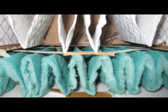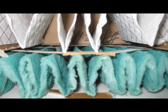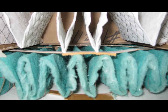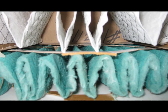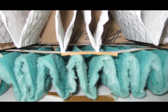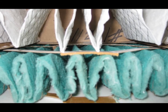The material of the media itself is also a factor going largely unchecked, mainly due to the fact that most pleated filters use a coarse fiber synthetic media as opposed to the more costly high-loft fine fiber. The big difference is in how particulate loads onto the media. With coarse synthetic medias, particulate loads predominantly on the face of the media, offering the lowest possible dust holding capacity. However, by using high-loft fine fiber media, the particulate can depth load into the fluffy media and still allow a path for airflow, resulting in significantly longer life.